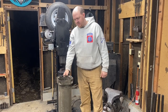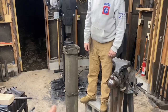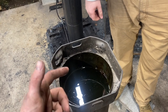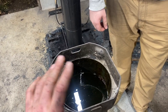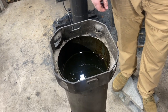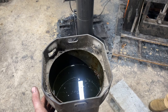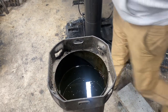All righty, so we're gearing up for the quench. The setup we got: Eric's got a cinder block to stand on, and we got a tank ammo tube full of vegetable oil — which is not the best quench medium because it's a lot thicker than commercially made quenching oils. If we heat it up to about 100–120 degrees or so and reduce the viscosity, it will harden the sword acceptably. We need to heat it up, so we're going to heat some scrap steel and dip it in there. Once the side of the can gets nice and hot to the touch, your oil is just about hot enough and ready to go.